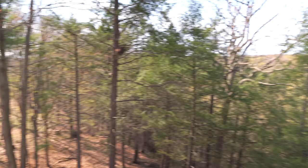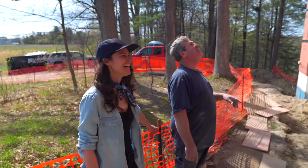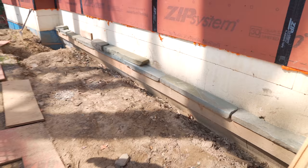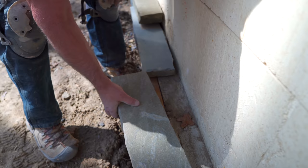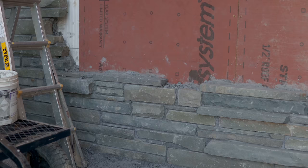It's exquisite — it really is a work of art. And no stonework up here, just the other stone is on the front down here. So we've got stone going in this area, all the way up to the second overhang. I just put some extra sixes there — my stone shelf is a little small here, the concrete shelf. So I nailed a two-by-four on just to give me a little extra when I lay the first one, then I'll go back with the fours.